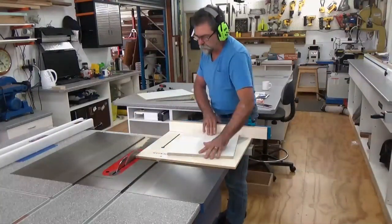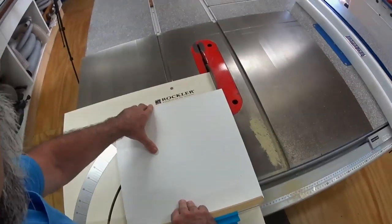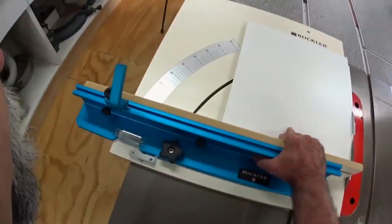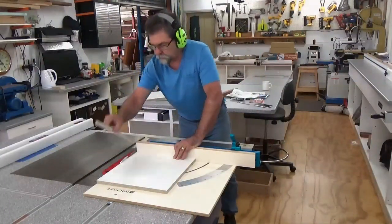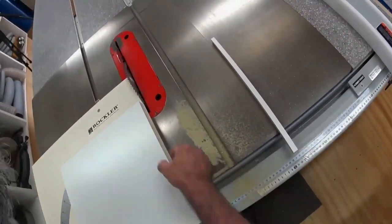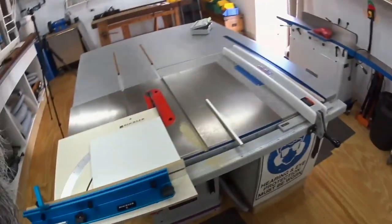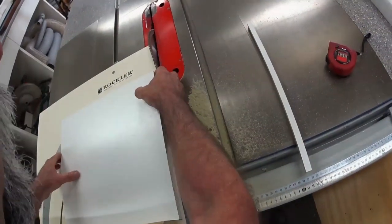Now the last one, we're going to rotate and we're going to hang out about, make it an offcut. We're going to measure that. Cut number five. Turn it off. Keep out of its way. Now, we're going to measure this, and we're also going to take it one more turn and have a look to see if it lines up with the side of the sled. I can tell you straight away, that's how much we're out. See that? So over 5 times 380 millimeters, I am out by that much. Let's get the calipers.